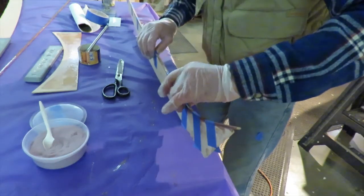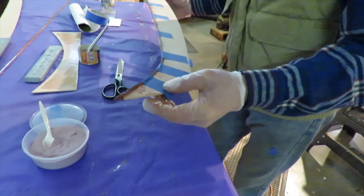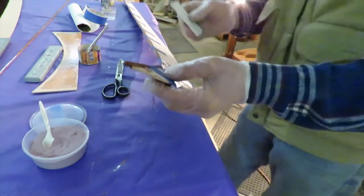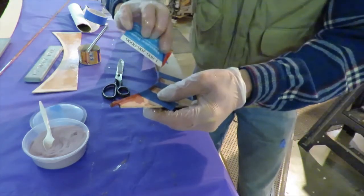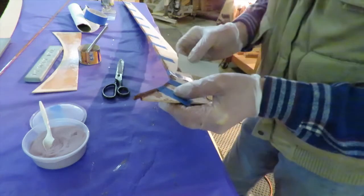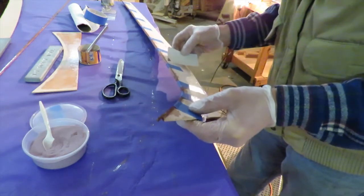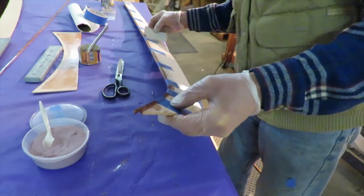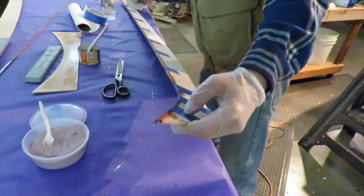That's pretty darn nice and I think our tape is going to hold. Now we can do a little clean-up, then we'll leave it alone. The business cards are good here - switching to one of our own cards, cleaning up right along the edge. If you're not quite tight in the curve, don't worry about it - just use some of the epoxy to fill in there. It'll be absolutely fine. You really don't have to be tight against it in the curve; the epoxy is plenty strong.